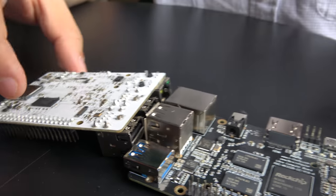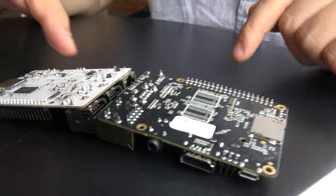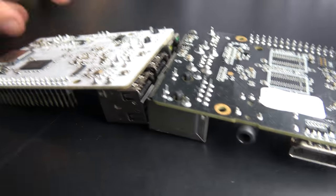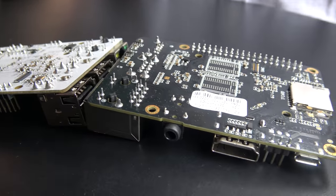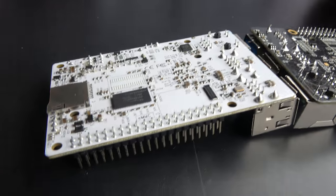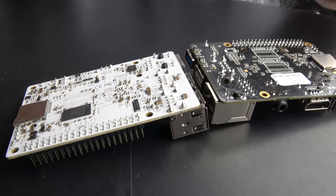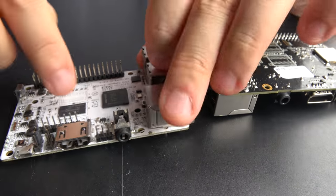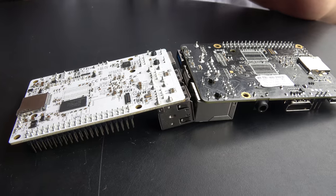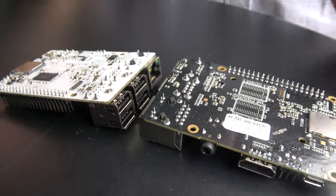There's a micro SD card slot that supports any micro SD card size. There are some issues people don't understand between FAT32 and exFAT — exFAT is needed for over 32GB. Raspberry Pi uses LPDDR as one chip for the entire board; we use standard DDR, which is faster than LPDDR in most situations. Performance-wise, Raspberry Pi is also good and they spend a lot of effort optimizing cost structure.